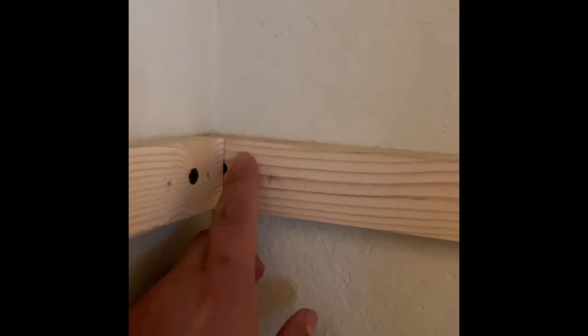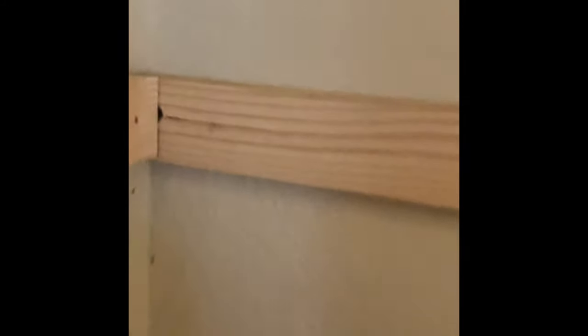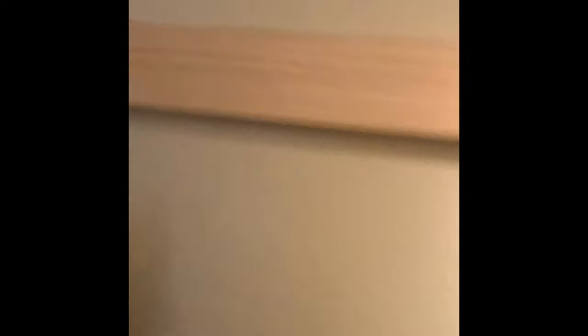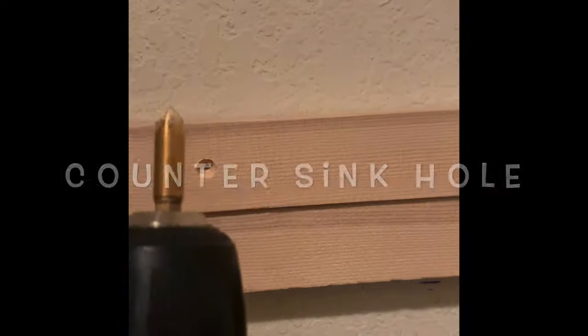I already started putting the frame for the shelves. What I learned is — see this crack right here? You gotta start it off with a hole here so that it doesn't split on you. You drill a pilot hole with your drill bit first, and then you make a little pocket hole with this tool. Now here's my line that's already level, so now I'm gonna put it on just to show you how I'm doing it.